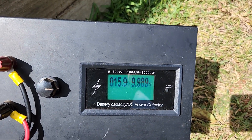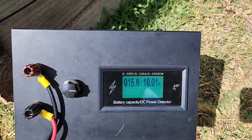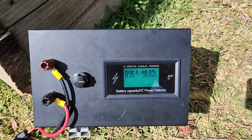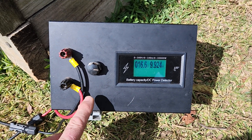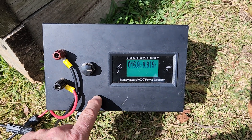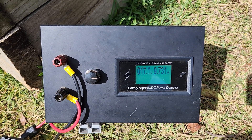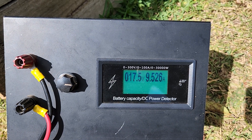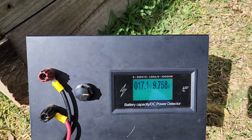That's quite adequate to drive an MPPT controller. With two panels I should be getting around 20 amps without any issue. So this is the old panel, and the new panel is doing exactly the same. There you go — 18 months old, Renogy 175-watt flexible solar panel. I'm using an electronic load here that dumps all the power into a constant current load, which lets me set the voltage and see what current it's drawing. It's pretty accurate, probably within 100 milliamps.